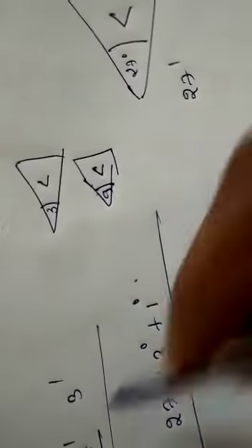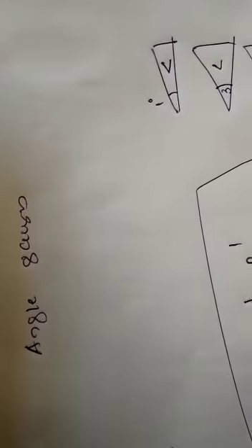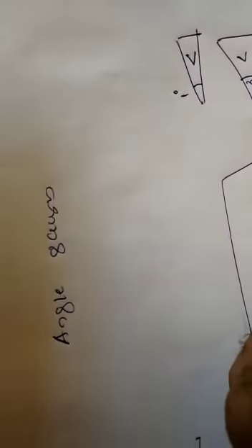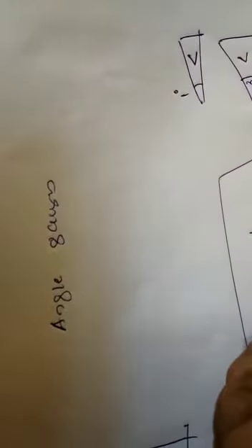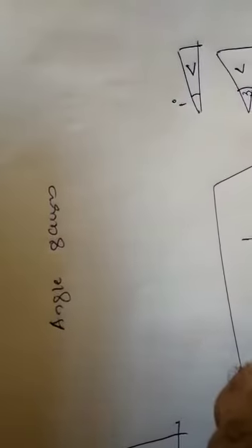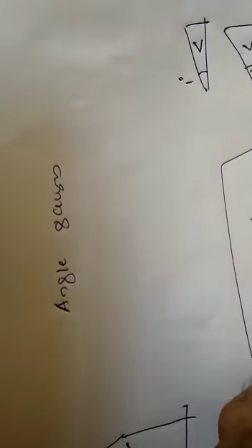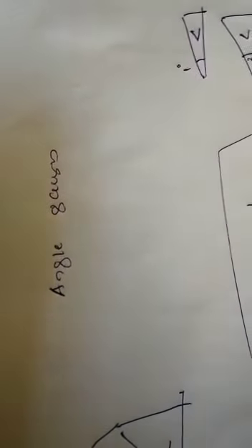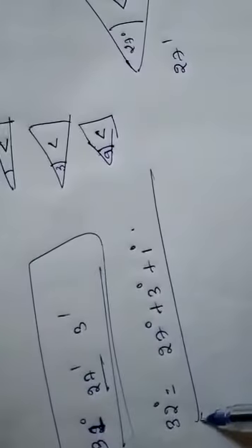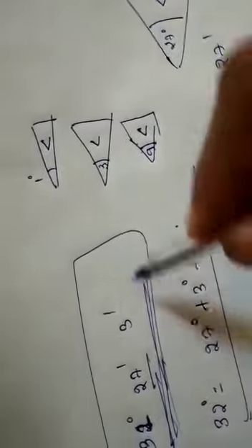This process is called addition of angle gauges. To build the angle, you stack: 27-degree gauge plus 3-degree gauge plus 1-degree gauge, giving 31 degrees. Then add the 27-minute gauge, and then the 3-second gauge. The total included angle becomes 31 degrees, 27 minutes, and 3 seconds.